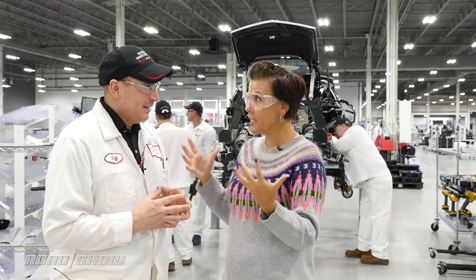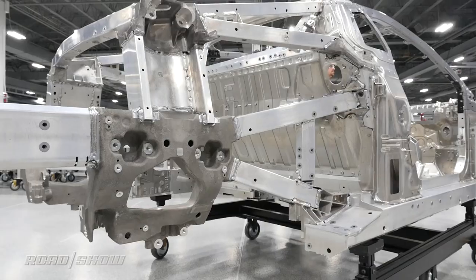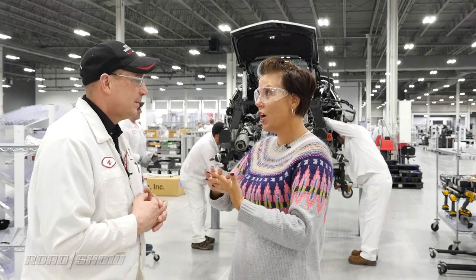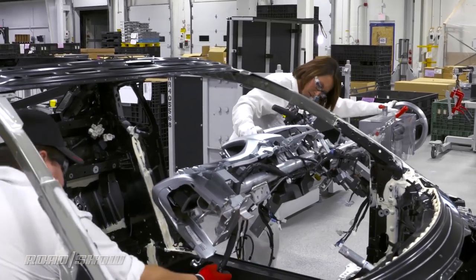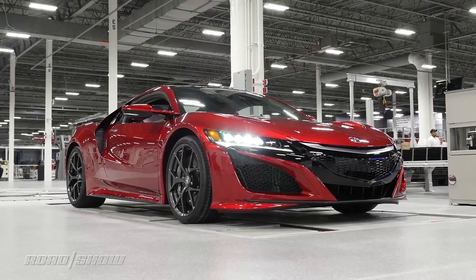In terms of how the car is physically put together, you're putting the engine in and all the components in before you put the body on it. When we get the body from weld, it's basically just a frame, and we put all the exterior panels on in assembly. We use glue or urethane to install a lot of the exterior panels, and fixtures — instead of robots — to install the rear fenders, front fenders, and doors. Paint gives a very pristine exterior finish, and we want to preserve that finish through assembly. So we put the exterior panels on in the very last process, which helps guarantee against chips, scratches, and deformation, and also allows us to make sure all the parts are perfect after the car is assembled.